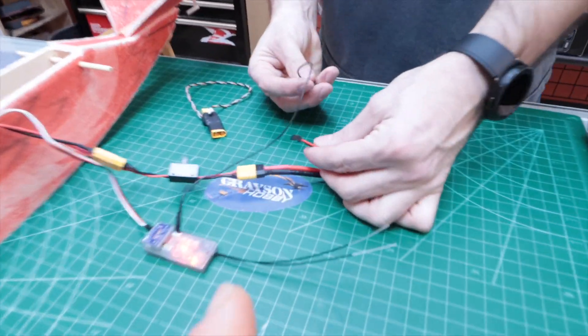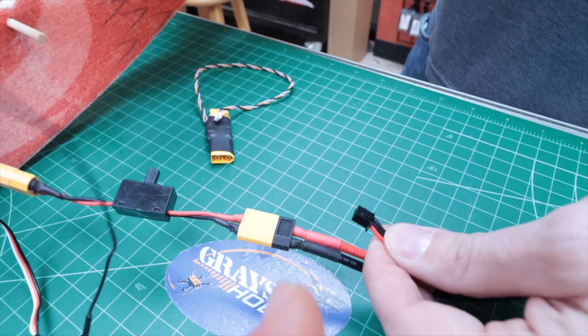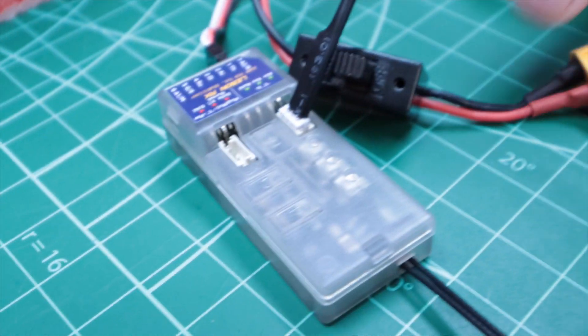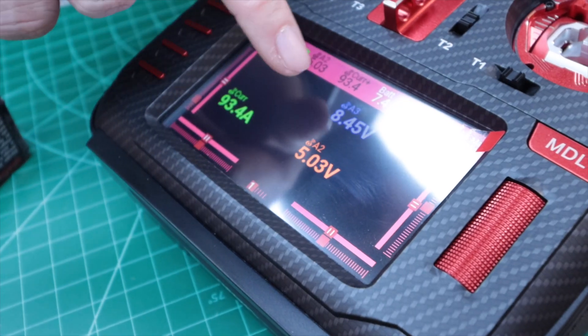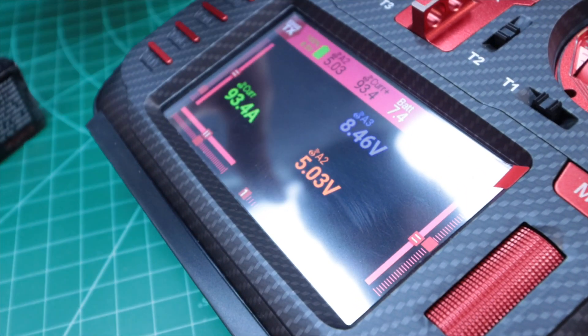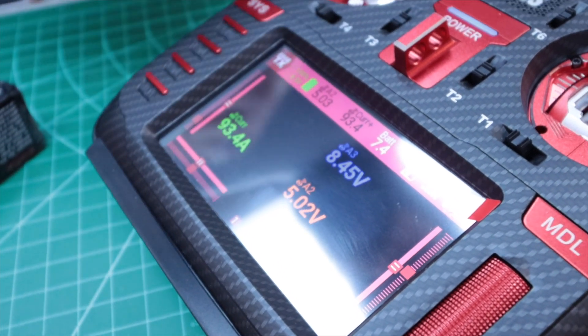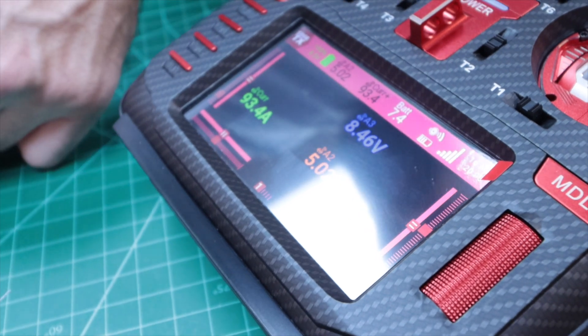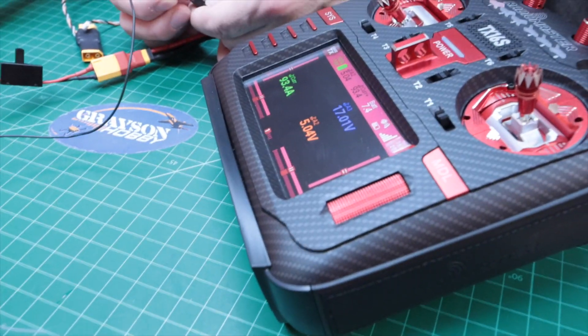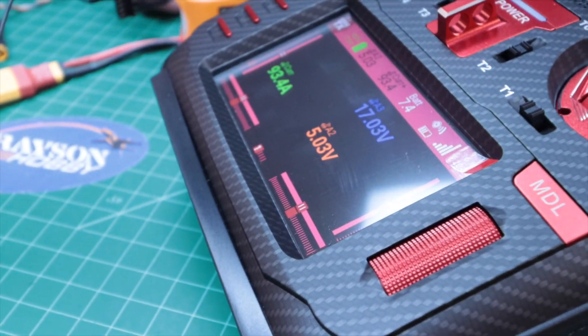So we know what the voltage feature does. How do you get it to work with the voltage-only probe? You plug it into the hot lead — the red one — and you'll see the pack voltage there. You'll still get your receiver pack voltage, which is what your BEC is putting out. So that pack is 8.5 volts. And if I connect a different battery — with the 4-cell — you plug in the hot lead and you can see the battery voltage.